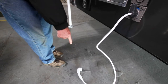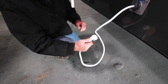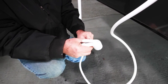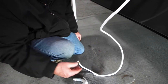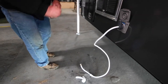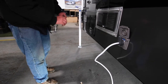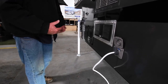The shower wand is clipped open. If you don't have a shower head like this, you can untwist the shower head itself and just leave it open on the ground — the water will drain out. This allows the water system to drain and opens the air lock so air can get into the system to allow water to gravity-feed out. Your tank drain will be draining at the same time. Once this stops draining, we'll hop inside and show you a few more steps.